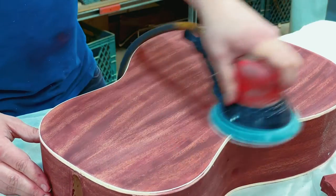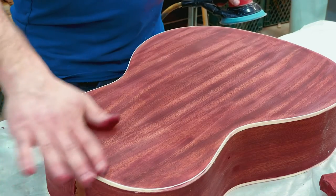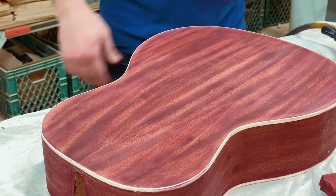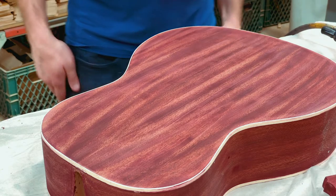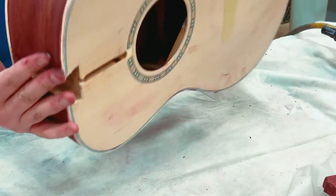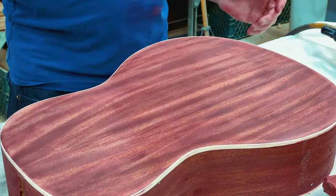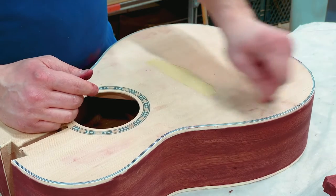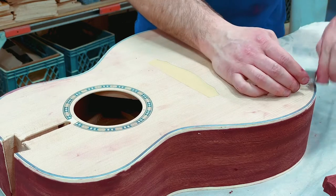Here I am evening out the back the rest of the way and making sure everything's nice and smooth, but also, like I said, abrading it a little bit so I can make sure that my paint will stick when the time comes to do the paint work. Now this is going to get another quick final sand after we get the neck glued in, and that will be in an upcoming video after we have filled the front, which is part of what we have to do in probably our next video. But for the purpose of this video, I'm just sanding it nicely with, I believe, 800 grit or 600 grit. I think it was 800.